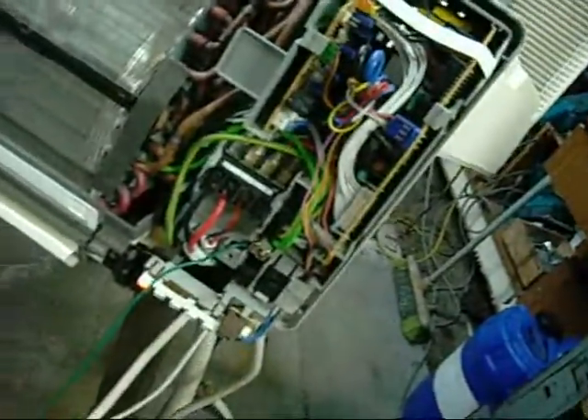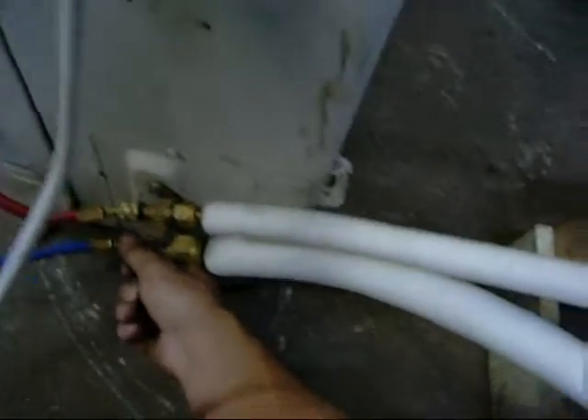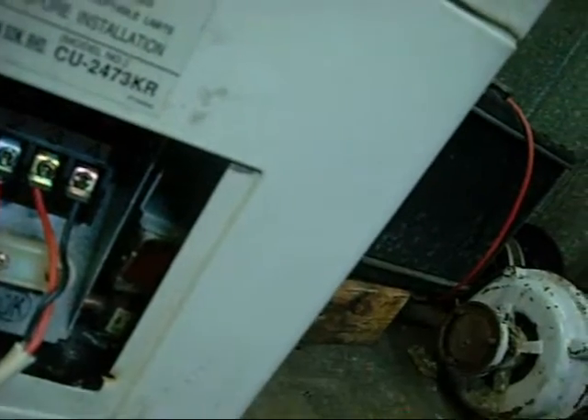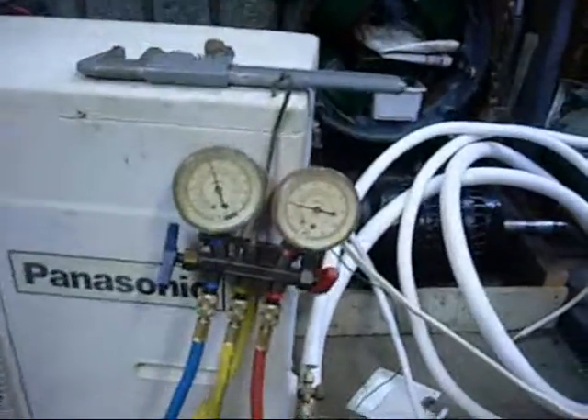I think that's pretty good. The coils aren't icing — they're sweating very evenly, and there's a lot of condensate coming off already. This thing's in good health — it's not surging either. I reckon they pumped this thing down 100% with the intention of using it somewhere and never got around to it. Sub-cooling coming back to the compressor — damn that's cold. One thing I noticed is this solenoid valve coil is loose. I'm going to take this apart and tighten that nut up on top of the solenoid valve. I don't know why it has that, but it was dumping pressure back to the suction side on startup — might be some kind of unloader. Sitting on 50 over 98 PSI — 98 on the high side, 50 on the suction side.